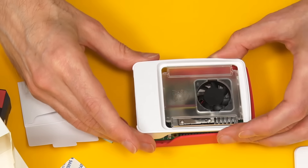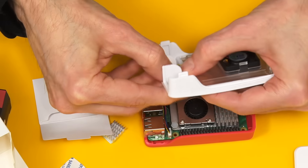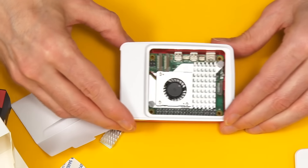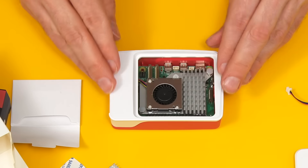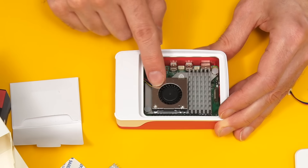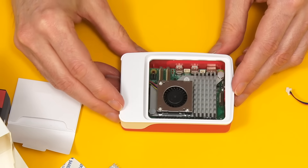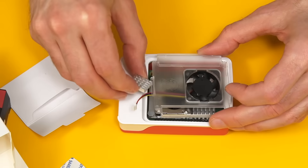The Pi clips into the base, and you put the top on — but you can't do that with the active cooler fan fitted. However, you can remove the fan mount piece and fit the Pi with the active cooler into the official case with the top off. That's clearly the most cooling you can get in this case. Our plan is to test the Pi in the official case with the active cooler, first with the top on, then with the top off, and then swap in the case's own fan and small heatsink.